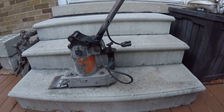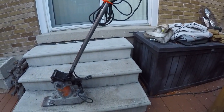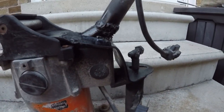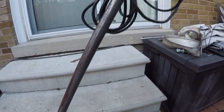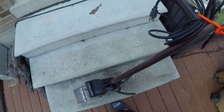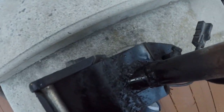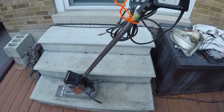And that's basically it. You guys can see in this next clip the angle of the handle is way higher than what it used to be. It taught me a lot though, because what I ended up doing was just a three-fourths cut on the piping handle and then re-welding it all the way around, which I originally should have done. I shouldn't have cut my original weld. But you live and you learn. Now it's done, sitting at the correct angle — which, at the beginning, I didn't know it was supposed to be sitting like this. The welds are definitely uglier and the piece looks pretty funny now, but at least the functionality is still there and it's completed as it should be. Don't forget guys, we all make mistakes — we just have to fix them.